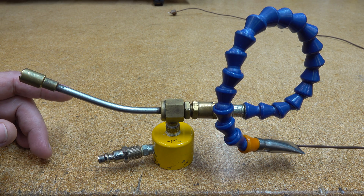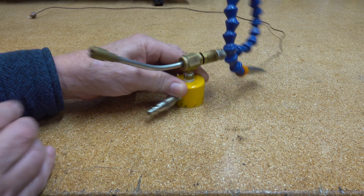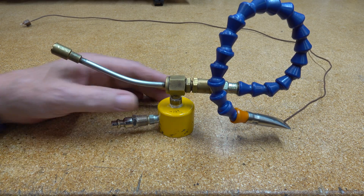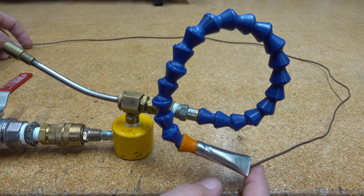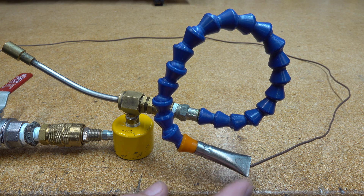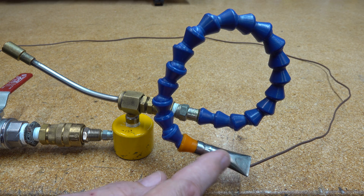There's a pretty good volume of air at 10 degrees below zero if you adjust it as cold as you can get it. This end is the adjustment — out one end comes hot air and out the other end comes cold air. I've taken the liberty of putting a temperature probe in the front of the nozzle. This is a very thin air curtain, about 30 thousandths — just under a millimeter — before these two would be completely pinched closed. That's how this tip works.